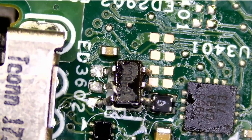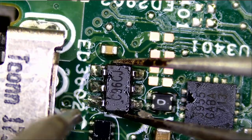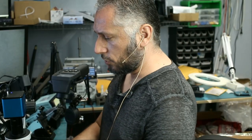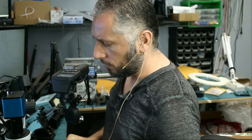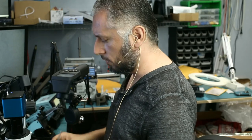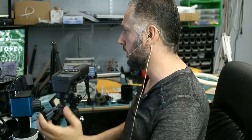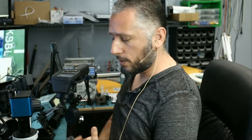Let me solder the chip back so we do not lose the orientation. So that's it — the power controller chip is what's causing the problem. Removing the power controller chip releases the short. The laptop will not turn on, of course, because we have to have that chip back in. We're going to tell the customer that we need to order the chip. I may continue this in a follow-up video when we get the chip in, to show you the laptop is working after we change the chip, considering there's nothing else wrong with the laptop. That's it for this video — hope you enjoyed it. Don't forget to like and subscribe, and we'll do something else in the next video.